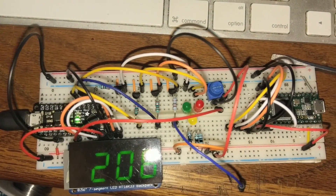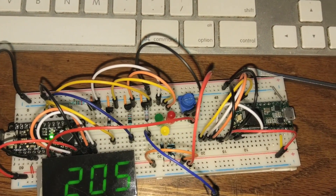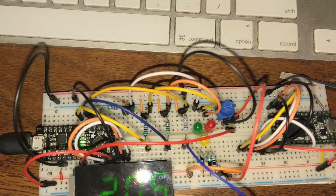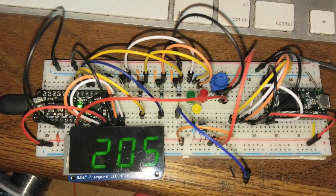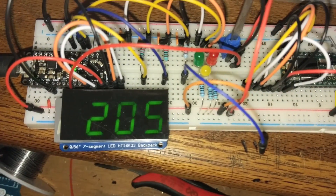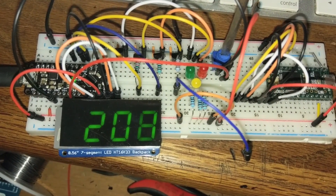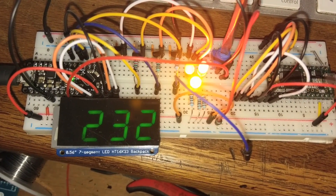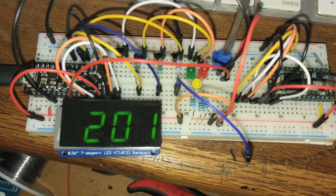This is everything I want inside my fan controller. We have four transistors: one is going to be the input for the AC signal, and the other three are going to be fan controller outputs. The three for the fans can go up to 600 milliamps, so they should be good for the relay coils. The only thing missing is the diodes for the relays to stifle the inductor. With a potentiometer in place of the temperature sensor: first we get low, then medium, then high. And when we bring it down, there's a little in-between so they can't just flicker on and off - there's a little hysteresis.